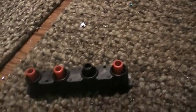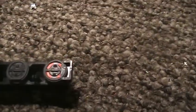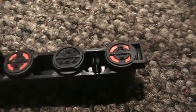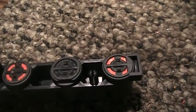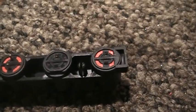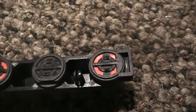After some research, I found that the meter shroud — where the probes plug in — has pins on the backside that go bad and break. You can see the pin sticking up nice on this side, which was the amp side. But over here on the regular voltage and ohmmeter side, the pins are broken off. When this was plugged into the board, the pins were supposed to stick out the other side, so resoldering did no good because the pins were broken off right where they meet the shroud.